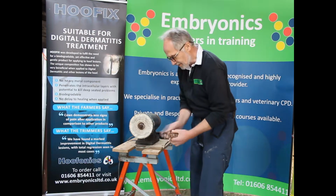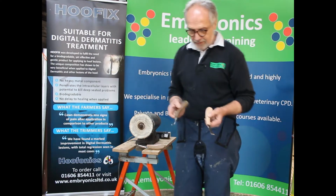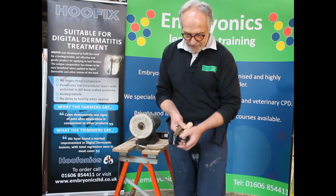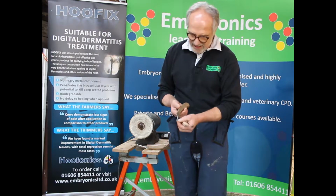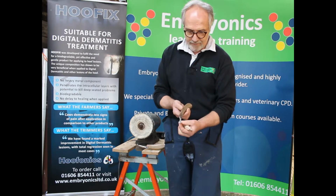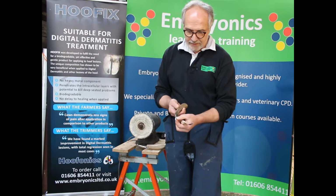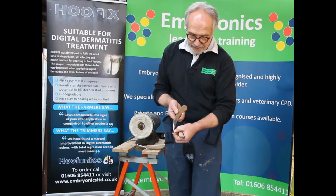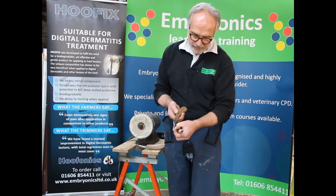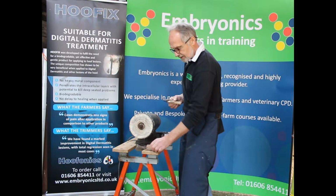We've also got the difference between, obviously, the new and the used knife. You're going to start wearing down your blade, and we've got one there on the right hand side, a used blade, which is getting towards the end of its life. Half of its thickness has been worn down, and it's going to get to the stage where it'll start to break. There is still a good thickness of the full thickness, 4 or 5 millimeters here, which still gives it quite a bit of strength. But those are the different knives.